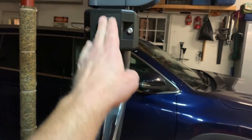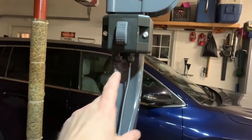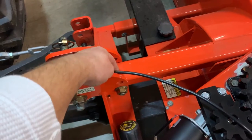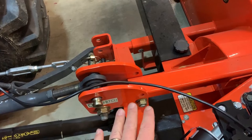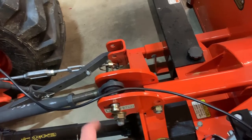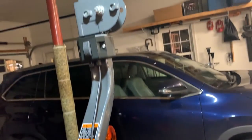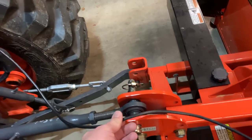I'm trying to decide how to route the cable. I'm really pleased with how the box came out. I think I'll run the wire on this side coming down and zip-tie it to the bracket for the top link. The blower is all the way down right now but may sit lower over uneven ground, so I want enough slack that I'm never pulling tight on the wire from the box — but not so much slack that it's blowing around or could get caught in something.